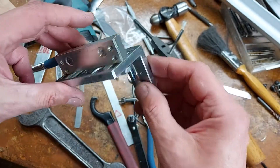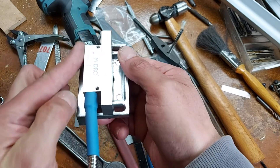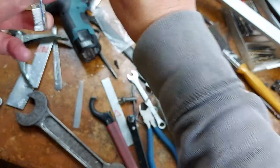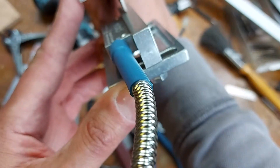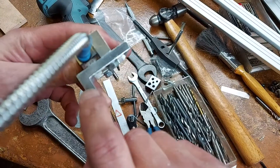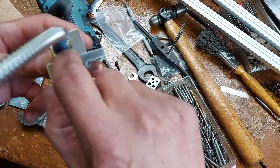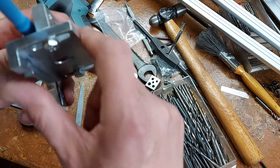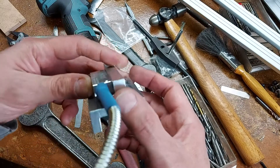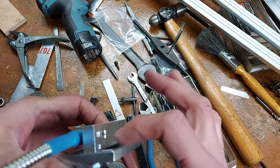This is the X-axis setup that goes onto the bed plate, and the magnetic encoder works on here. The issue is that the cover doesn't fit. The cover wants to come to there, so what I need to do is move that support from there to underneath. I'm going to machine this thinner, then put it underneath there, and I'll also have to bolt it from that way as well — so there will be bolts that are blind into the sensor. Then it will be mounted onto this bracket. I'll do the machining on this bracket — make it a very thin slice that sits under there.